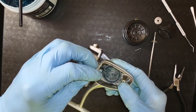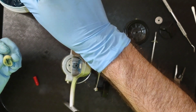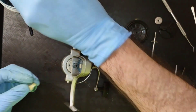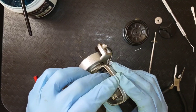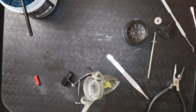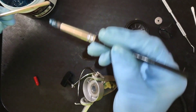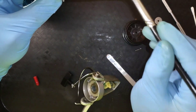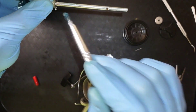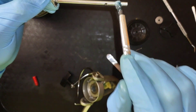Now we can put the crosswind block into place. I just rubbed off all of my grease, so I don't have a lot on it. We're going to stick it on there like so. Wipe this excess grease off of my glove, and with what's on this brush I'm going to give this shaft a light coat. You don't want to put a lot on here because it will just push it off as it goes through the pinion.